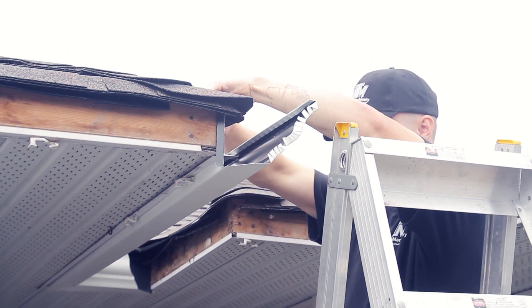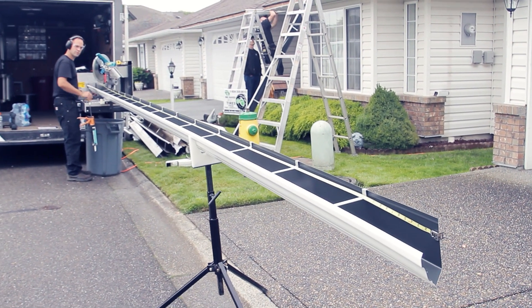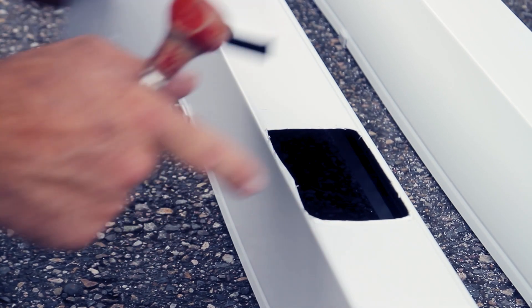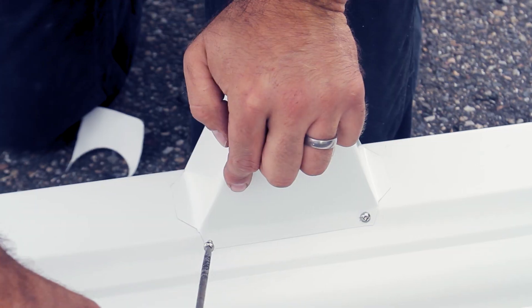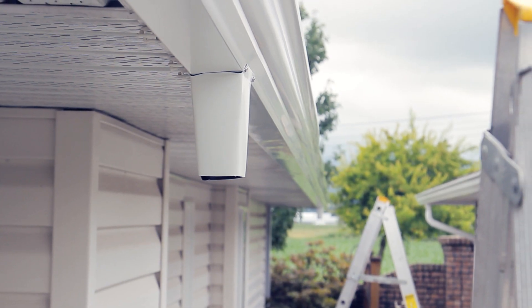Sloping towards the outlet is a very important factor when you're installing gutter. There was quite a bit of footage on this house, but the good thing is that we installed high flow funnels, which means that your outlet is bigger, making the water flow easier down the spout, meaning it can take way more volume of water. Now Max will explain how to install a gutter, what screws we use, and the spacing that we have on the hangers.